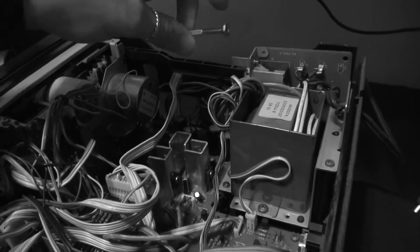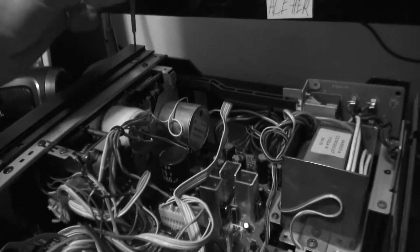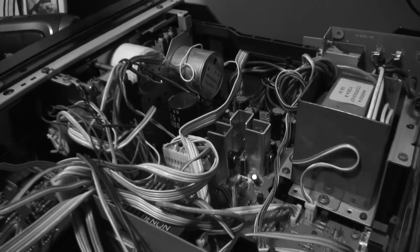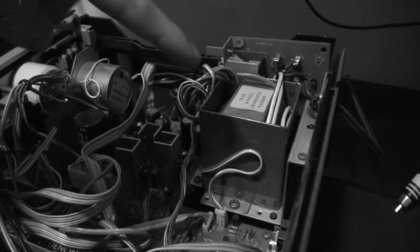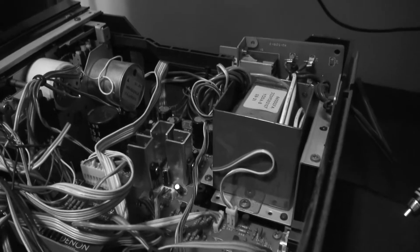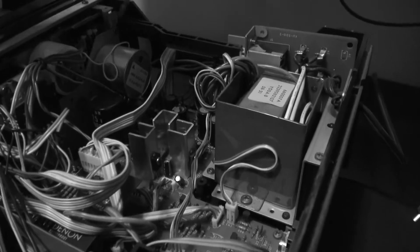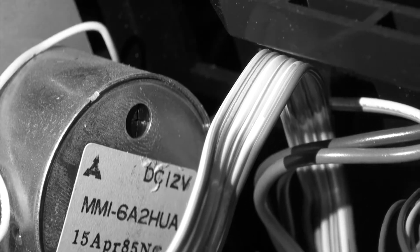If the screwdriver is too big to fit cleanly, either wrap it well with tape or take the entire assembly out, adjust as needed, put it back in, test, and then secure all the screws back. You do not want to complete this circuit — it can carry power even when it's not plugged into the wall. I let it discharge for over a week before making these adjustments just in case. It shouldn't kill you, but it'll definitely hurt — so don't get zapped by old technology.